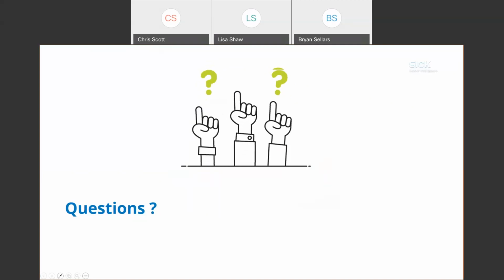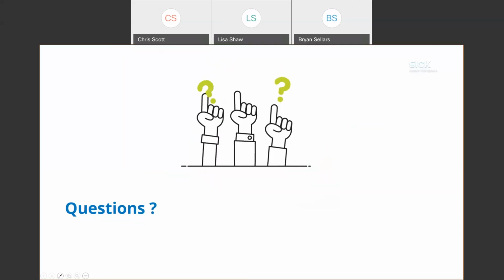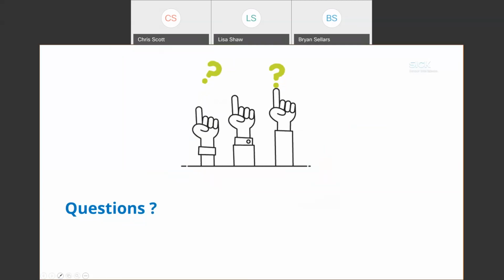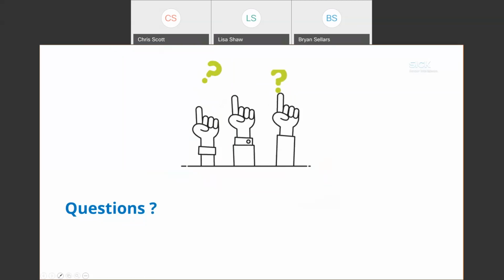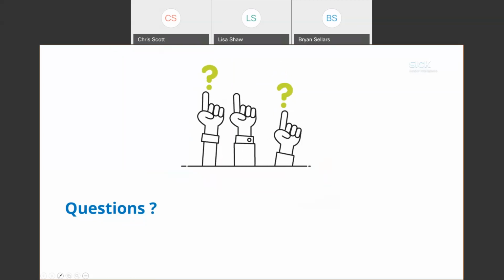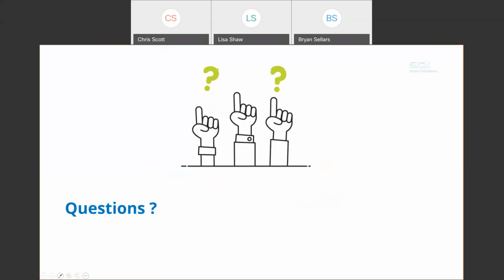The next question is, in the SICK Stop UR Cap, what is the warning field used for? Oh, it's a good question. With the SICK Stop UR Cap, the scanner that we use is the NanoScan 3 Core, and that has one safety rated protective field, and then we can use a warning field. The warning field is a kind of wild card in the sense you can choose what you use it for. The system will allow you to maybe turn a light on or have some type of alarm giving people notice that they're approaching the application. But it's not going to affect any function of the robot. We're not going to slow the robot down or stop the robot in the warning field. We're just going to let you know that you're close. Once you continue closer and actually infringe upon the protective field that's close to the robot, then the system just stops. And when you leave, the automatic restart will take place. The warning field is really, truly just a warning field in that system.